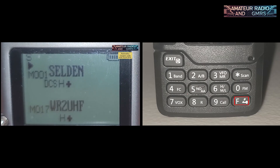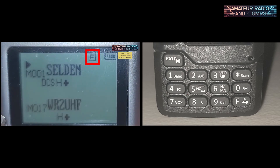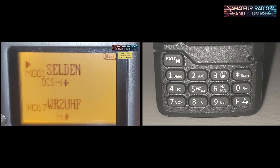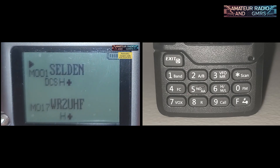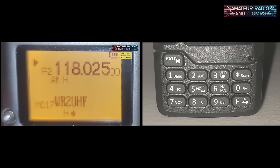On the bottom right-hand side, you see the letter F with a little lock on it. The F is your function key that brings the radio into a different level of options. There is a timeout on it — you can see the F appear on the top of the screen and then disappear after a moment. Note that you must be in VFO mode for the band key to work, so we'll hit Function then VFO to enter VFO mode.